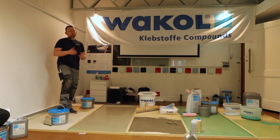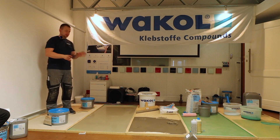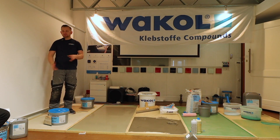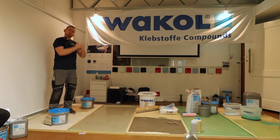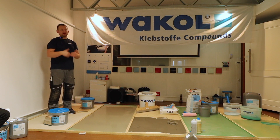You can also install LVT with a pressure sensitive adhesive and it works fine, but with LVT quality going down and when we compare pressure sensitive versus wet set, a wet set adhesive will always give you higher shear strength. It will penetrate — or rather grab — the backing of the LVT or PVC sheet better and give you more strength to the floor, especially when movement or solar exposure starts happening, like on a house with high solar gain.